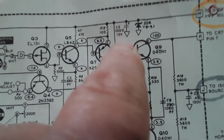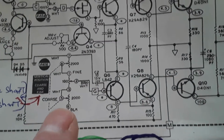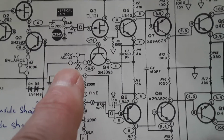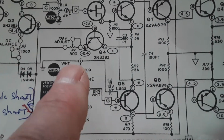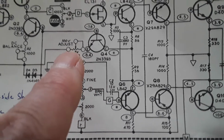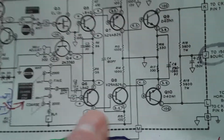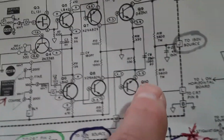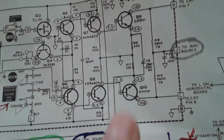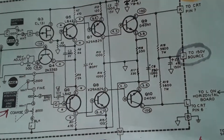Got this voltage regulator. I put that black capacitor in there where I was supposed to adjust this voltage adjust wherever it's at. 100 volts adjust so that I get 9 volts at the positive of the capacitor. Was in one step, then a step or two later, it's having me adjust that again to get 100 volts, I think, at Q9. Then after that, you have to adjust the, where the heck is it, the balance, which is way over here, to balance the voltage on this collector to ground and this collector to ground. Keep going back and forth with your meter to ground and equalize those, you know, get them close together, which I can't do that. I'm still blaming this.